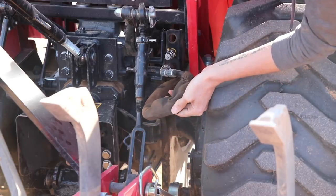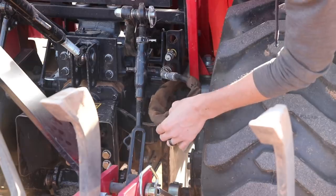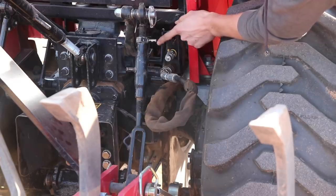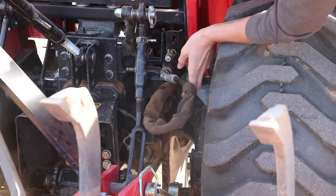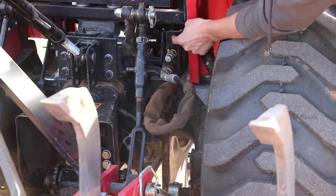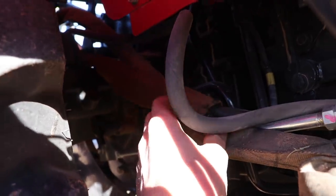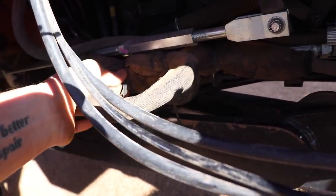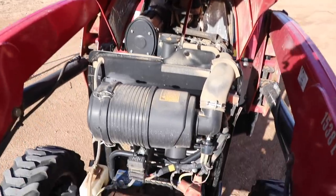This hose cover wasn't on it stock when that happened. After it happened, I've gone ahead and added these abrasive coverings to all the hydraulic hoses that seem quite exposed and are not well protected. The guy from Earhart also came out for service and just detached this hose from the bracket here since it was annoying running through the hole. Under the tractor here, I've added more abrasive covering to all the hydraulic hoses. This long one I had to zip tie up because it was wanting to rub against the tire, which wouldn't be good.